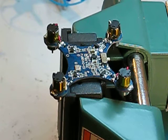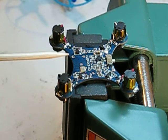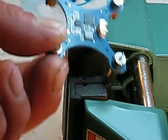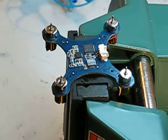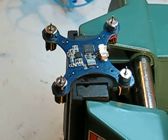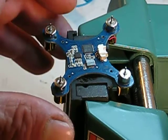Anyway, right here on the bottom side of the blue board is where they got the antenna grid in this area, and that silver circle right there is where we're going to hook up our antenna, but on the other side. So we'll flip it over to the top side, and there's a silver circle. It goes through, and if you put a continuity tester on it, it should beep. That's what I've already done, but to save time we won't do that. It's on the end of the string of these components here, and it's a lot nicer here on the blue board to put the antenna.